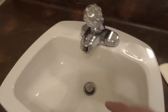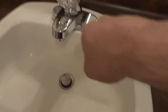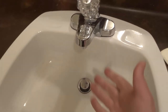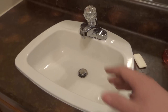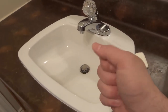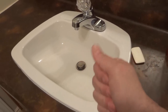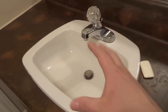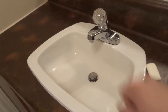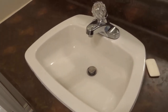If it doesn't fix it, move on to step number two, which is the cheapest and easiest option: boiling water. Just literally boil a pot of water, get a kettle, and pour that boiling water down the drain. Do it with at least two to three kettles worth of water and see if that helps. Usually what that's going to do is disintegrate any mildew that's built up and clogging the drain. It won't necessarily get rid of hairs, but if you disintegrate the mildew, whatever debris or hairs are clogging the drain might make their way down and you'll have an unclogged drain. It's pretty much next to free, and it usually does the trick in most cases.